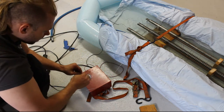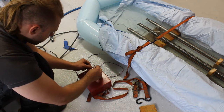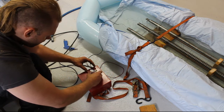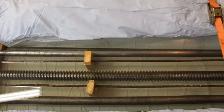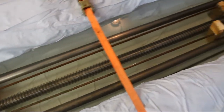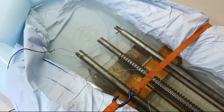With a very hazardous connection - believe it or not, I've done this before and not burned the house down. One hour in - all the sketchiness aside - things are bubbling nicely. I can see bubbles forming on all the sacrificial plates and rebars, and also on all three rods to be cleaned. I added some additional plates to the ends just to reduce the shadowing effect.